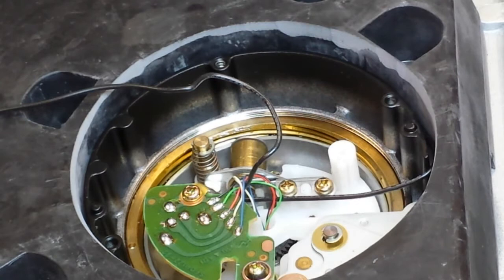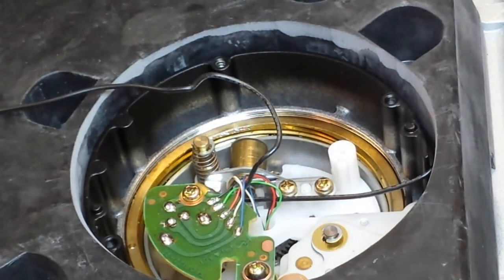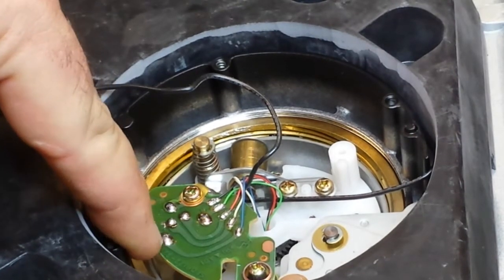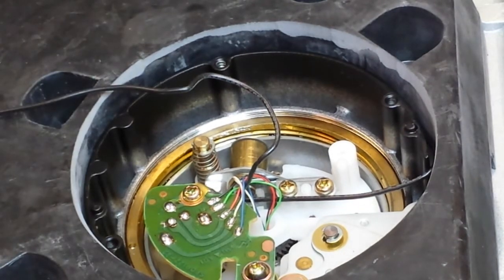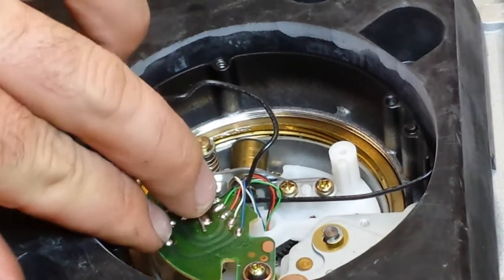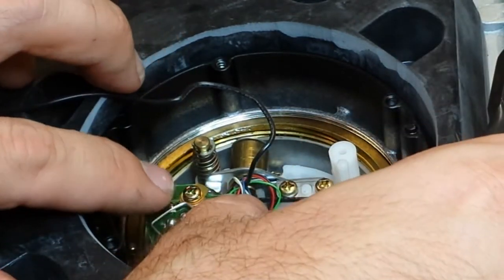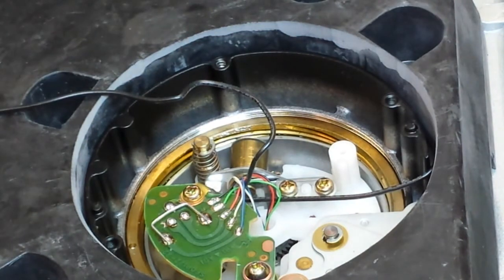Now you can do the unified ground with a strap, like an old piece of lead from a wire, which is what I use — all these little lead pieces I clip off of things that I replace. Or you can use a piece of wire. What you're doing is you're connecting the negatives here and here to the chassis ground here. You're just jumping them all together, and that's unifying the ground system. In most cases, the chassis ground of a hi-fi receiver is at signal ground potential anyways, so while having a third wire to go down will cause a ground loop, this mock-up shows how it's going to work.